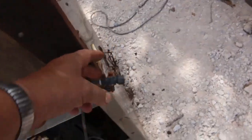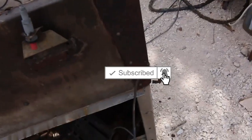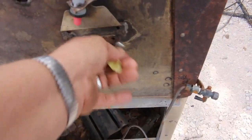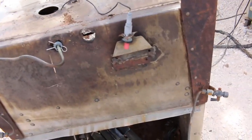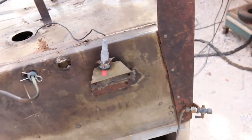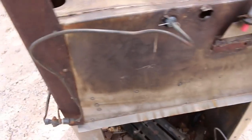Brass, so I'm just going to cut this off and later I'll grind the steel off of there, get down to the clean brass. And I've got a magnet here, so it's not sticking there, it is sticking here, so I'll have to probably cut around that piece and see if I can't separate it. I can probably cut it here. Magnet's not sticking there, so I can probably cut this here, get that piece of bracket off, then cut around that magnetic steel.